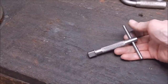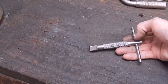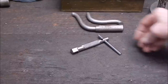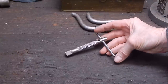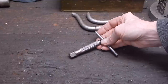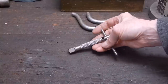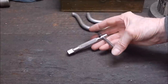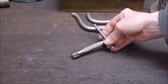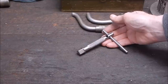I'll put this in the collet — it'll hold this no problem on the knurling, won't mark it. I'll just take that back a fraction and drill another hole. Well here she is, the final product — didn't turn out too bad, not bad for a backyard. It's nice to have a knurled gadget — they're really handy. I can use it just to do it up with my fingers, put the little crossbar in and tighten her up, and it'll be good for those hard to get at areas where you can't get a ratchet in.